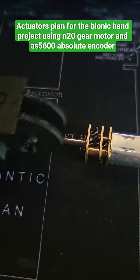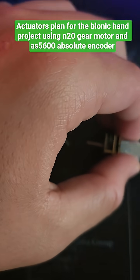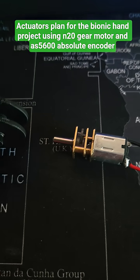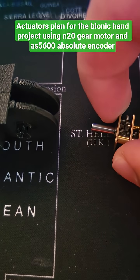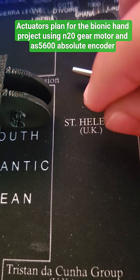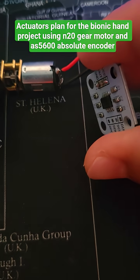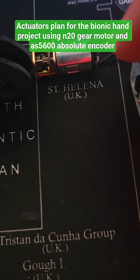The plan is I'm going to attach it to the back like that, and have a fishing reel that pulls the wire around like a winch. There's going to be a gear on the winch right there, and then it meshes and goes along a shaft along here, then meets up with this AS5600 encoder, so I can get position control kind of like a servo.